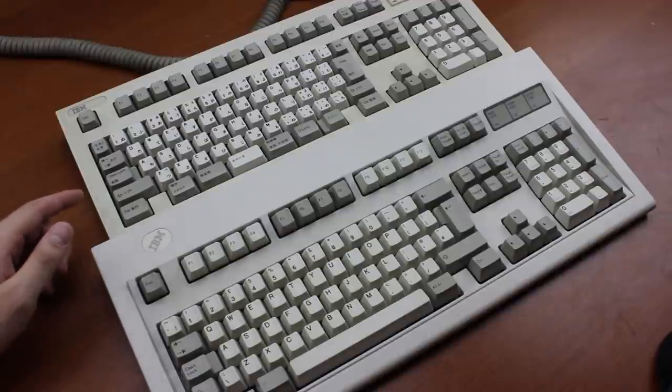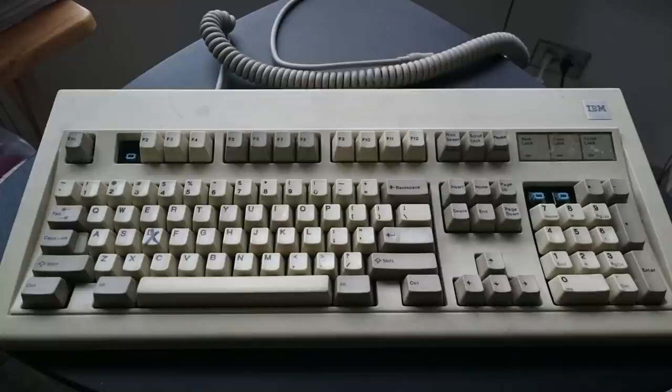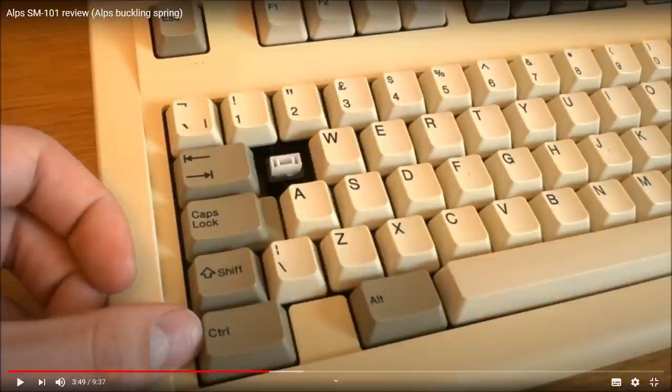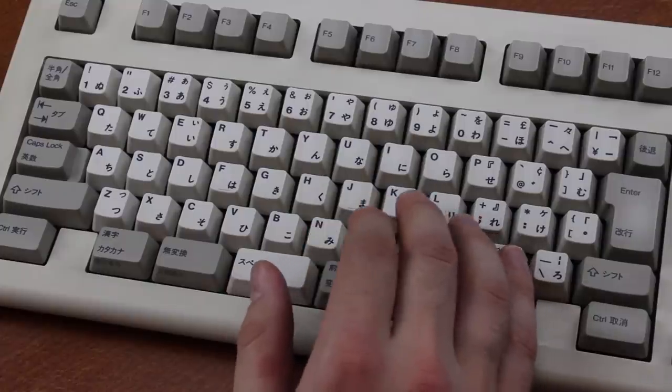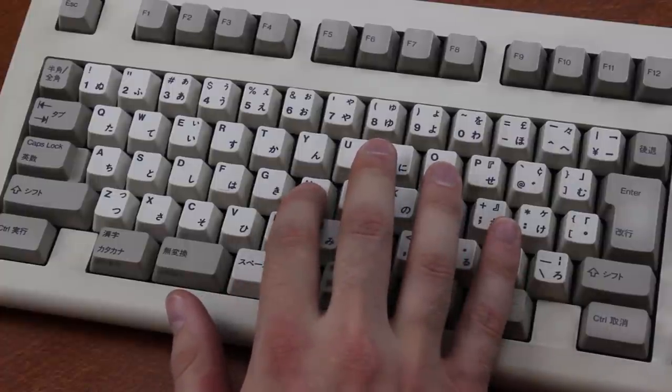Check it out if you want to know how these switches work. There were also actual Model M-shaped keyboards with blue ALPS switches in it, but these are said by some to be bootlegs. Rather than using a coil spring that buckles — of which ALPS also had a design, by the way — this uses a plate spring that inverts under pressure, and it's closer in design to a beam spring switch than to a buckling one.